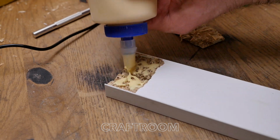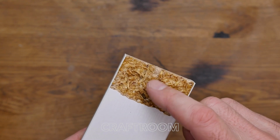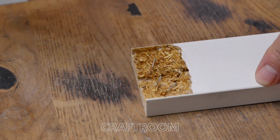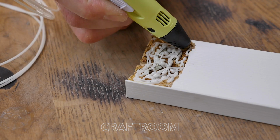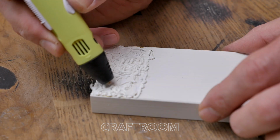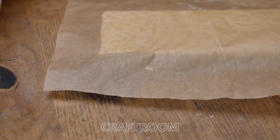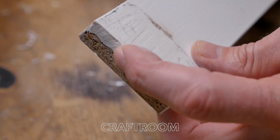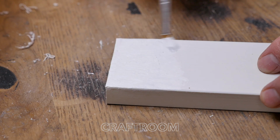So I coated our surface with PVA adhesive. A thin PVA film will be a special intermediate layer, a primer for combining two dissimilar materials. We add a few brackets for reliability. We heat the surface for better adhesion and begin to fill the entire space with molten plastic. Well, we cover everything with oil paint or spray paint.